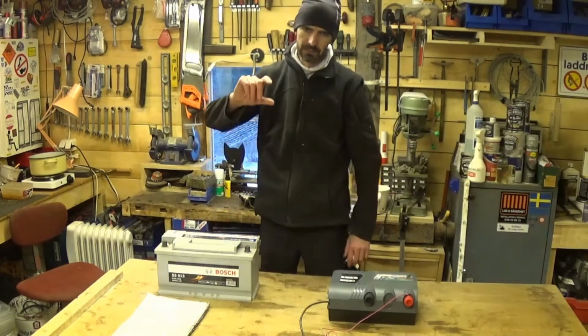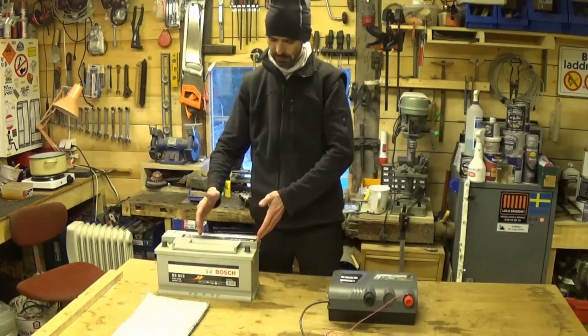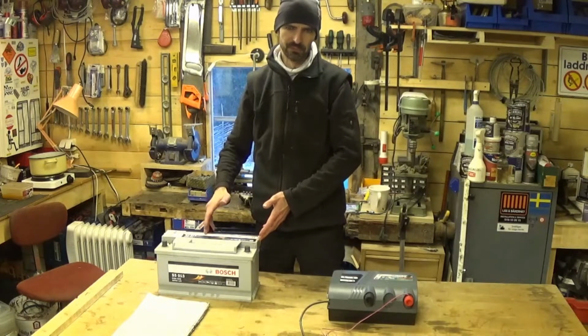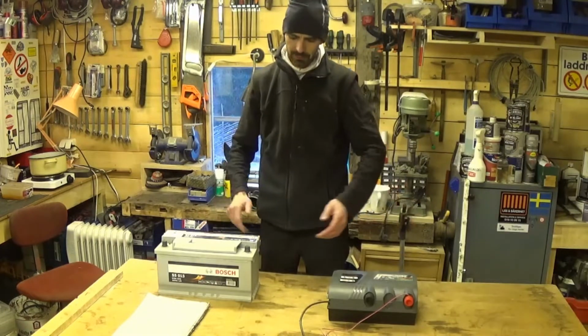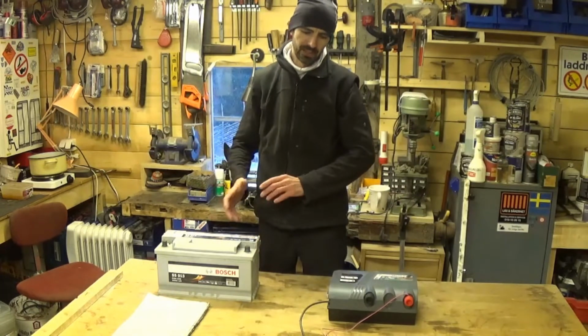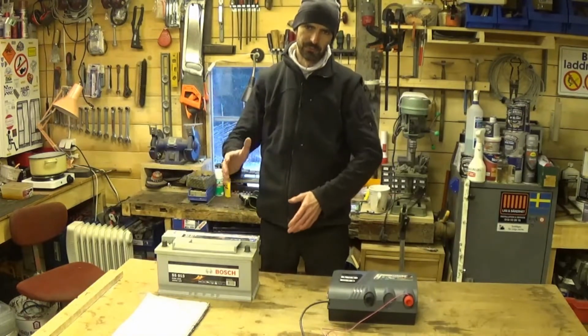You don't want one of those little 9-volt batteries that you put in your smoke detector. You want something maybe not quite as big, but at least half that size, so that it's got the capacity to run the fence for a couple of weeks. And this will run the fence that I've got down in the village for about a month. That will vary depending upon how large the fence is and how much undergrowth you've got.